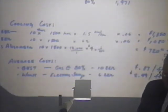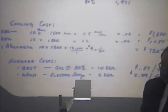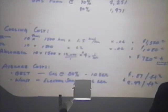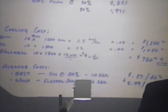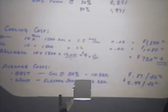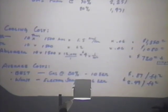And by the way, a rooftop unit, I recently had a project where I was trying to get a real high efficiency rooftop unit. An 8.5, 8.6 is good for a rooftop. Mike was talking about the units being inexpensive, the less expensive buildings, cheap buildings, buy rooftop units, or you buy splits that are not very good. You get into the better efficiency equipment when you're starting to talk about chillers, cooling towers, or gas-fired absorbers.